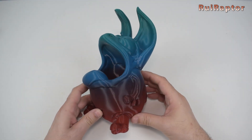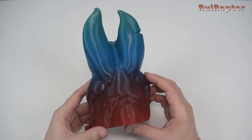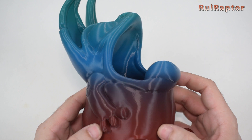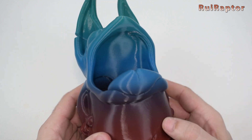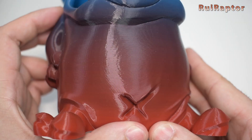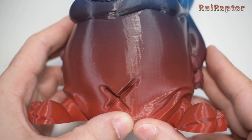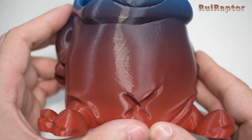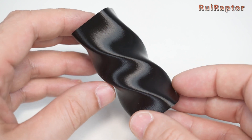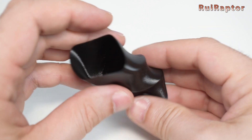This next model was printed using rainbow filament and it looks awesome. However, although this machine is equipped with TMC drivers, we can see a bit of what seems to be the salmon skin effect. Most of the prints were done with PLA filament, except one which was printed with flexible filament — the dual-gear extruder had no issues printing with TPU.